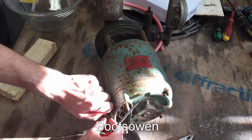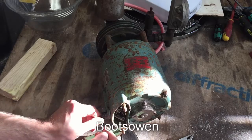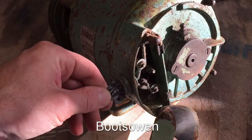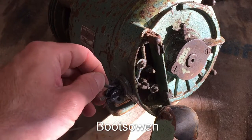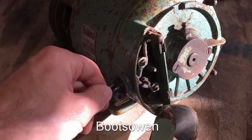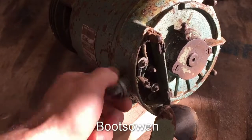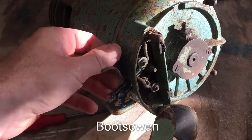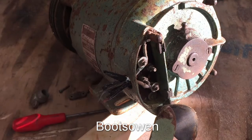The wire is all seized up in there. A bit of tape as a gland — it's a bit nasty. We've got an earth going up to the terminal, we've got a neutral. The cables here are quite bizarre — it's a bodge job completely. These are black and red, but the cables are a greater size and brown and blue. I have no idea what's going on there. It's like they're jointed somewhere — they're actually just taped joints. People have their own ways of doing things. I'll get a new cable and wire it up.